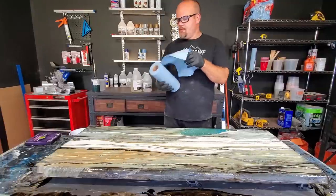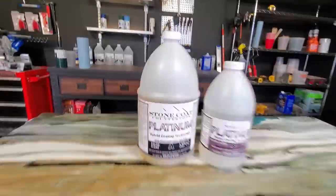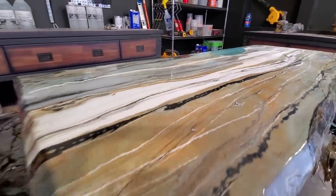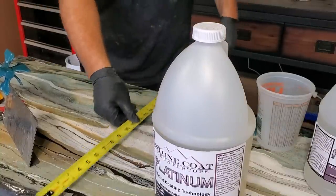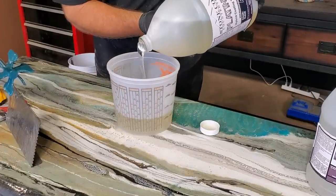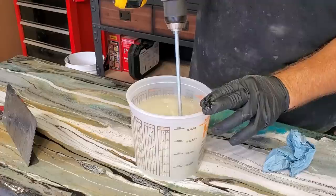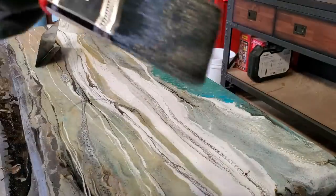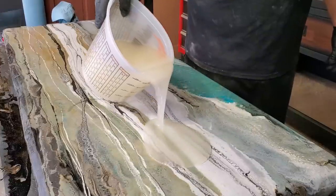The clear coat is the same as the color coat, but easier — I'm not going to add any additives this time, just clear. I'm going to use Stone Coat Platinum at a two-to-one ratio, mixed in a bucket for two minutes using a drill. I've measured my desk and I know exactly how much I need — three ounces per square foot. I'll put this in my mixing container, use my paddle mixer, and I have my one-eighth by one-eighth square notch trowel ready to go, along with my chop brush with any loose bristles removed.